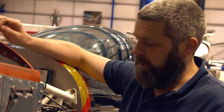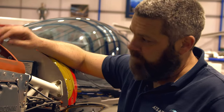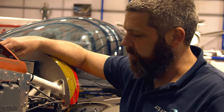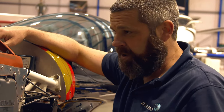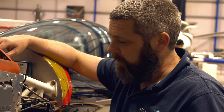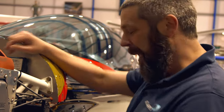One of the most important things we need to look at on this particular aircraft is the engine frame — the frame connecting the engine itself to the fuselage. Unfortunately on this aircraft it's an area of weakness. There are a number of bulletins out on it looking for cracks and any distortion in the metal in the structure. You can understand when the aircraft is stressed to plus or minus 10 g, that great big lump hanging off the front is definitely an area of weakness and certainly an area we need to pay particular attention to.